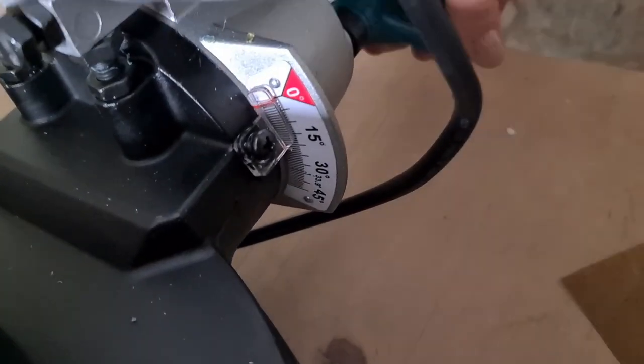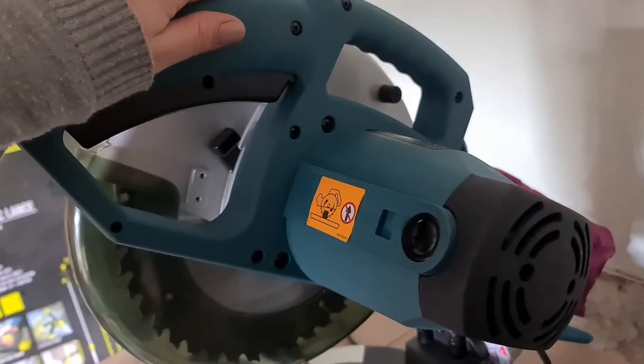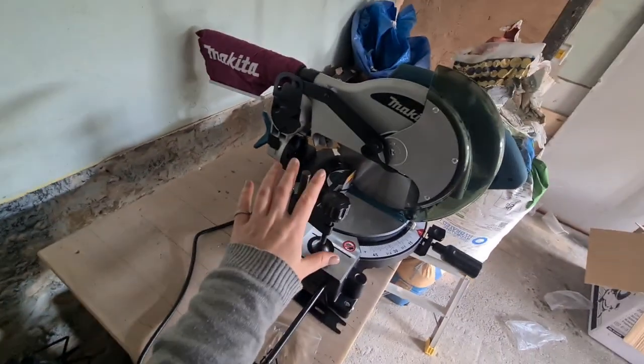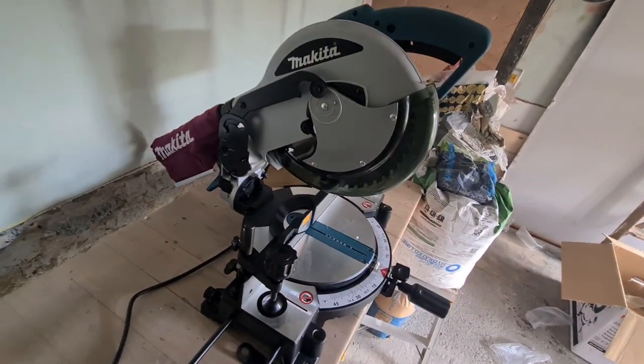They do the same job, but because this one is a funny shape I assume they put that in to make it easier to transport. This is the angle it was talking about — once it's arrived, you take that bolt out and make it straight. Now this gets tightened so that the angle stays correct for cutting, and the saw arm won't move. If you press that bolt in the arm doesn't stay — push it in properly. That's for storage and transportation, so pop that bolt back out and then the arm can come up.